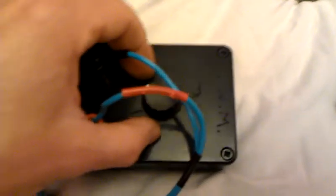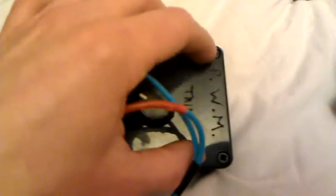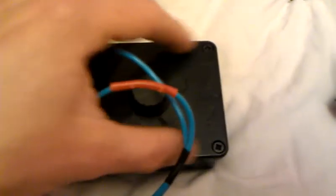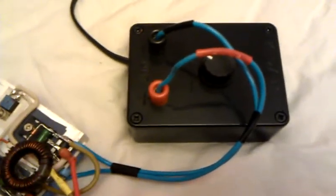What I've done is basically take the MOSFETs off the board and put them onto quite a large heatsink — a bigger heatsink — so that it'll handle a little bit more. And once I've connected it into the project box I've been able to use it for motors and things, like that and bigger DC motors.